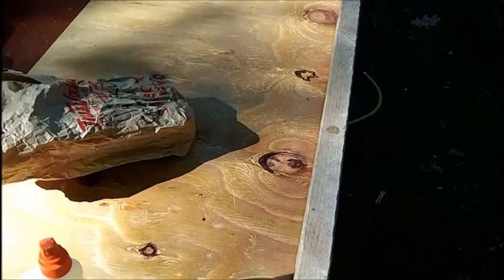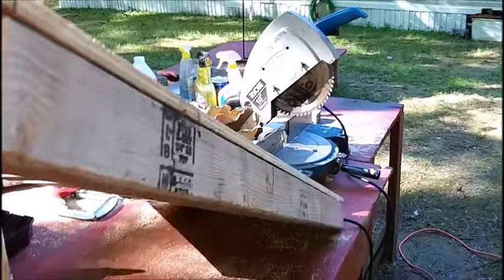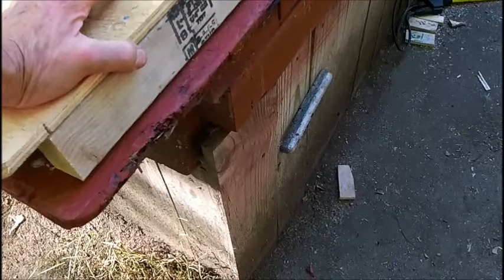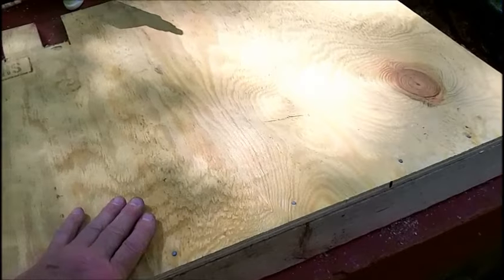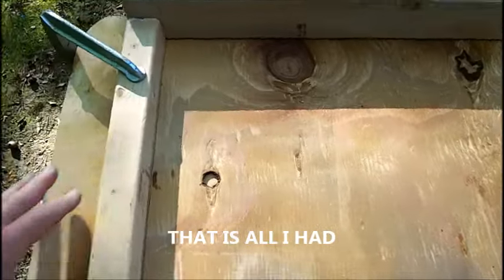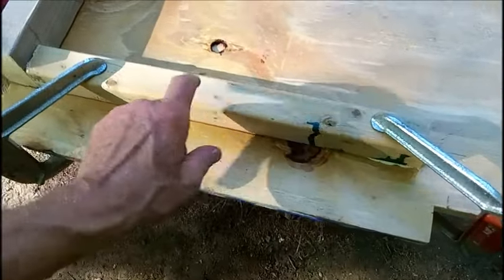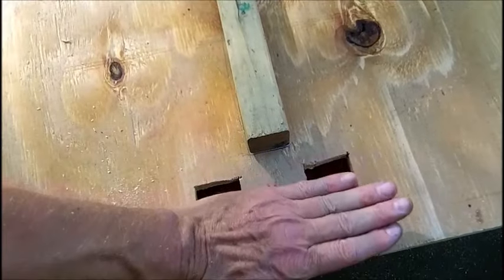So let me get going on that. Alright, this is what I did — this is the bottom of course. I don't have any more 2x3s so I can't put an end cap in here. Now what we've got to do is put a centerpiece support in the middle — either a 2x3, or if I have to use a 2x4 it'll go up underneath anyway. I'm using 2x2s here, actually 1.5 by 1.5. The 2x3 is the front face of the bench, recessed back about 2 and three-quarter inches, glued and nailed. And this is the center support, and this is the back wall.